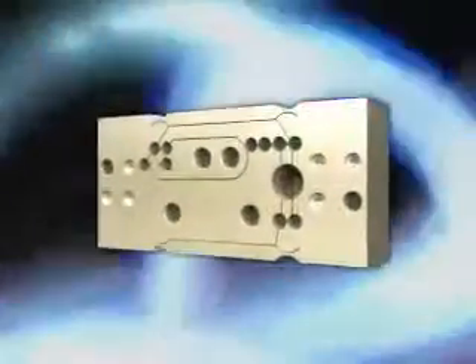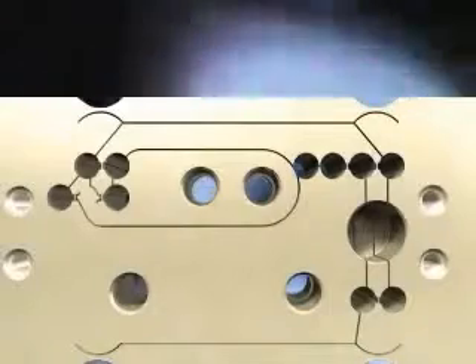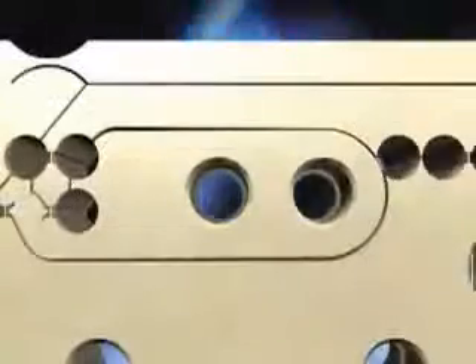What has transformed this fragile, heavy, error-prone balance into a strong, light, highly accurate balance is the UniBlock. All the workings of this high-precision electromagnetic balance have been machined into this single compact block. UniBlock is the result of using a special technology called high-precision electric discharge processing, with a precision of plus or minus several microns — a process that finely cuts a block of aluminum down to less than 100 microns while suppressing the generation of residual stress. This compact body uses a two-stage design where, when a load is applied, two levers move in tandem. The movement generates an electromagnetic force returning the second lever to its original position, and the weight value is determined from the amount of current required.